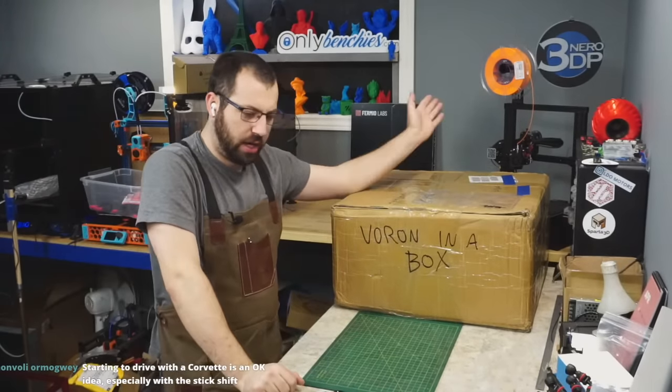Idlers. Okay. So these are your XY joint idlers. Uh, 4020 can't be a Sunon. Yeah, I don't think Sunon actually makes 4020. So, yeah. Okay. So here's your XY idler. I am not a huge fan. This is separate from the Voron dev team. I am not a huge fan of these idlers, okay? These pin bearings have a tendency to explode. They really don't last too long. There are some higher quality ones that are a bit better. They last a bit longer. Personally, I just go with an F695 stack.